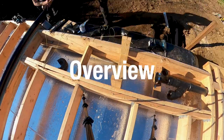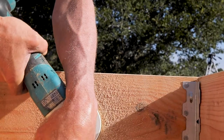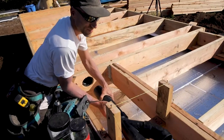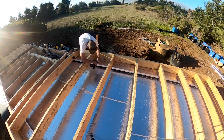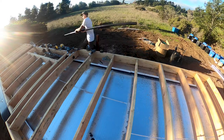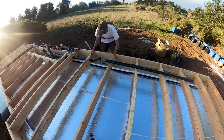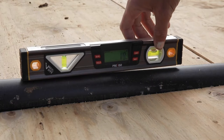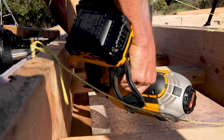Let's take a quick overview of what we hope to accomplish today. We will first install the wastewater pipes and fittings. We'll be using ABS pipe for the wastewater lines — ABS stands for acrylonitrile butadiene styrene. You shouldn't use ABS for water supply, and you would be correct not to. However, ABS is a very common material for wastewater lines since it's relatively inexpensive and easy to install.